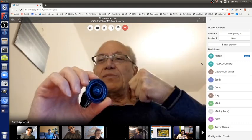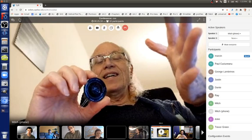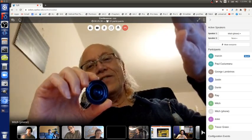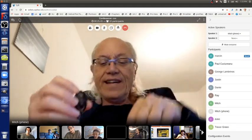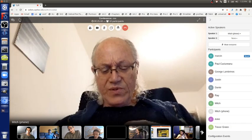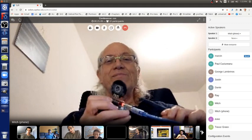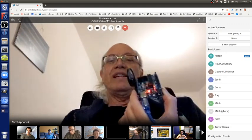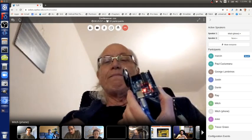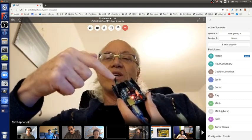If we just turn a speaker on and keep it on, it'll make a click when we turn it on. And then later, when we turn it off, it'll disengage, and we'll hear a click when we turn it off. And that's what'll happen here, once per second. I don't even hear this, because my microphone won't really respond. But right now, every time the controlling firmware thinks that it's turning the LED on, the speaker clicks. When it thinks it's turning the LED off, it clicks again.